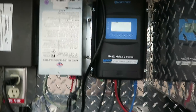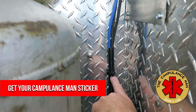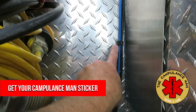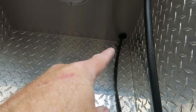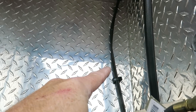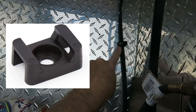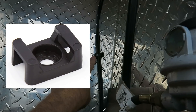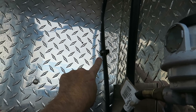The cables come up here secured to the back wall, the blue cable splits off and goes behind the panel to inside, and then the cables go up to the panels themselves on the roof - snugged up against the wall. These are some really nice screw-in wire holders - they're great, you can zip tie to them and they're screwed in so they're never going to come loose.